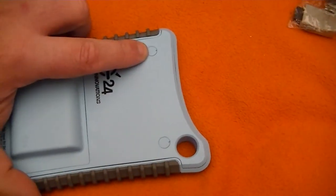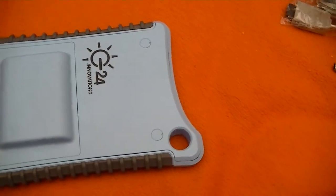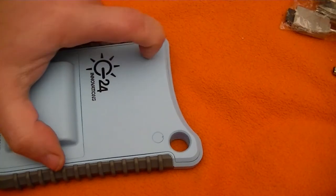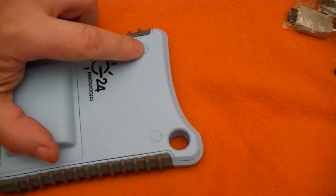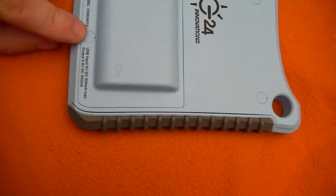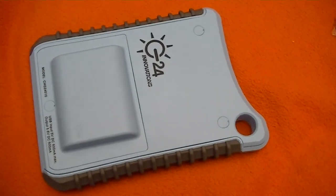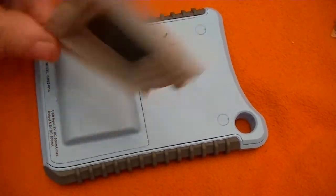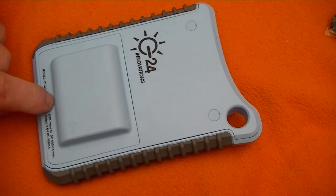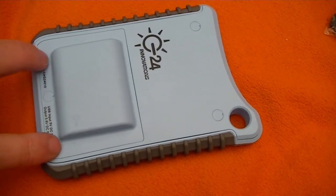You pop out these little plugs. They're these little plastic plugs that cover the screw holes. Just take a really sharp paperclip. Might do it. Might not be strong enough. But a little pick. Stick it in there. Pry it up, they'll pop right out. You have one down here. Once you pry that off, this battery compartment comes off. And once you take the battery compartment off, there's one more screw right here. Take that off. Two screws here and here underneath the battery.